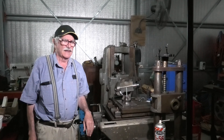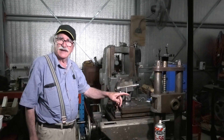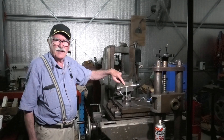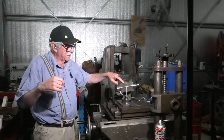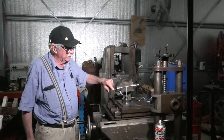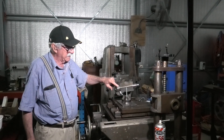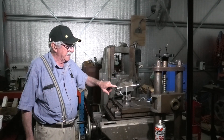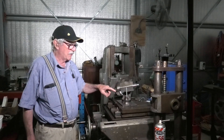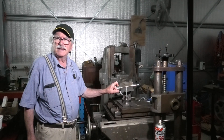A couple of things have happened. There's a handle extended now — that was an easy one. I've put a slot in here, and I'll bring you in closer later. The slot allows an indexing latch to drop down into the indexing disc at the back, and that can have as many divisions as you want. I went for two and four on this one.